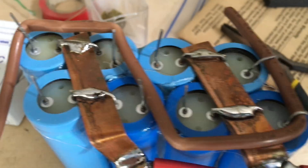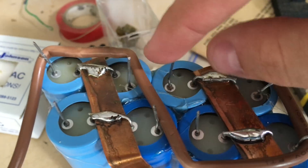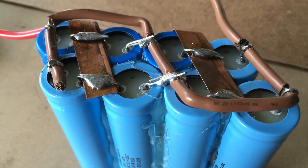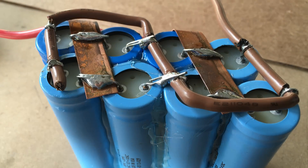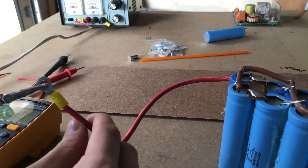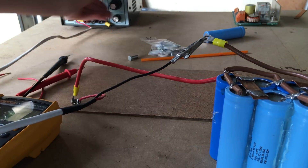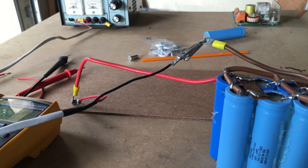Now it's on to the negative lead. I'm going to snake the negative lead all the way through the bank and connect all of the negative terminals to it. This is what the negative lead looks like stripped before it's been soldered in place. This right here is what the final capacitor bank looks like. It's time for the first power up. I'm going to hook the capacitor bank positive to the positive of the power supply, and negative to the negative of the power supply, and I'm going to start the voltage very low and turn it on. We'll stop at 38 volts. There it is — fully charged.